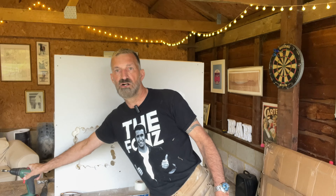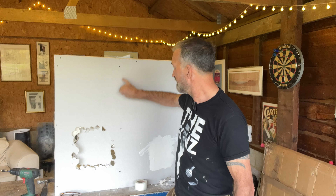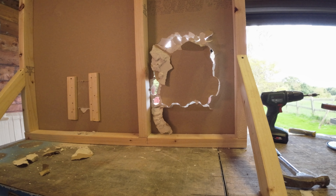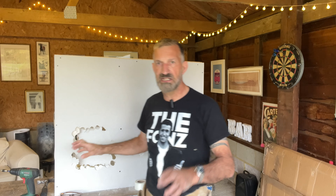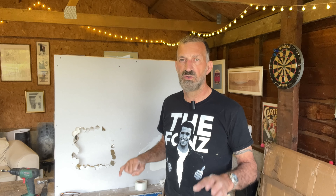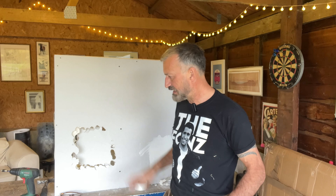What about this humongous great horrible hole here? Similar job to before. However, if you follow these screws, we've got the studs either side. A fairly standard measurement between studs is either 400 millimeters or 16 inches, so you can kind of gauge where the studs are. So let's clean this one up — take the knife, get the big bits off.